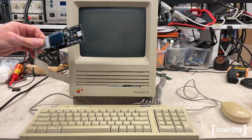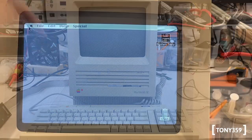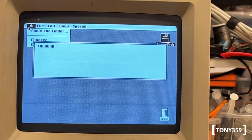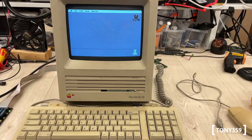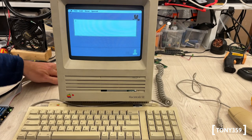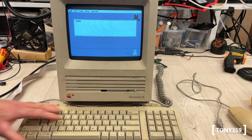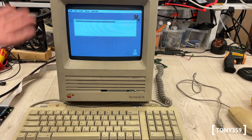The next step is to load a startup disk using the floppy emu and see if I can use the keyboard with the debug console. We are in the desktop and the mouse does the same thing, so let's open the debug console. When I type, each keystroke produces four A's — two when I press and two when I depress — and all keys on the keyboard produce exactly the same action on screen. I'll need to look a bit deeper to understand this.